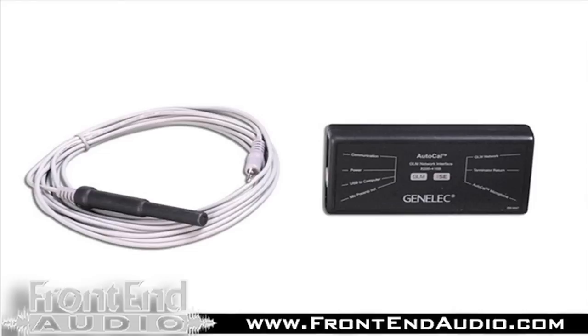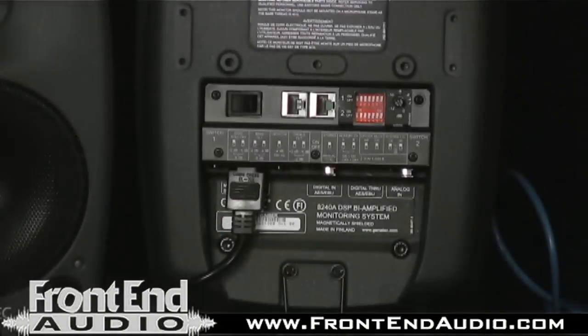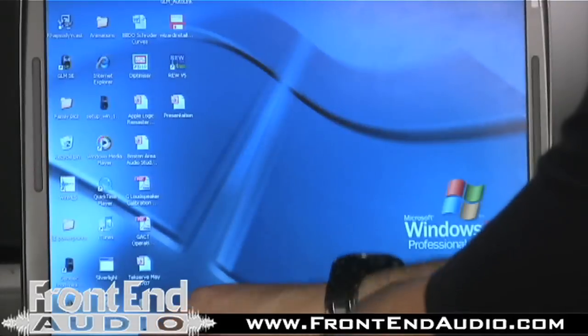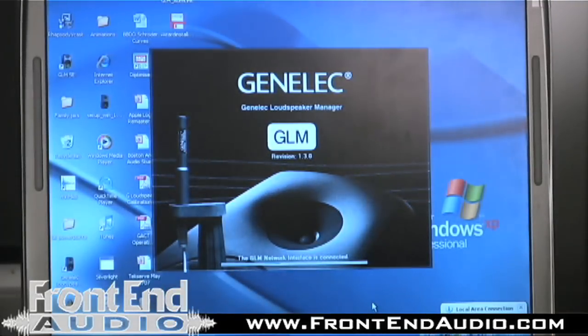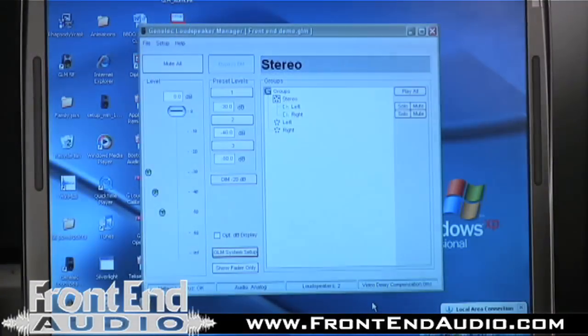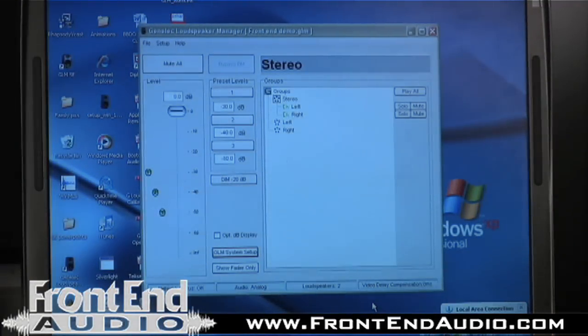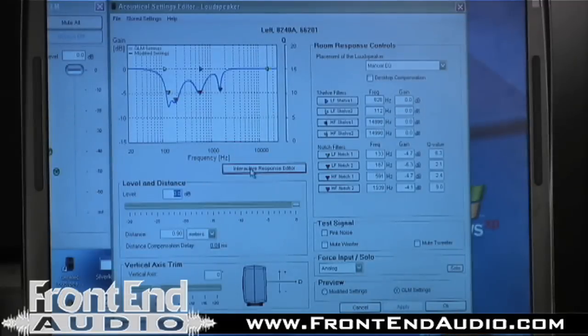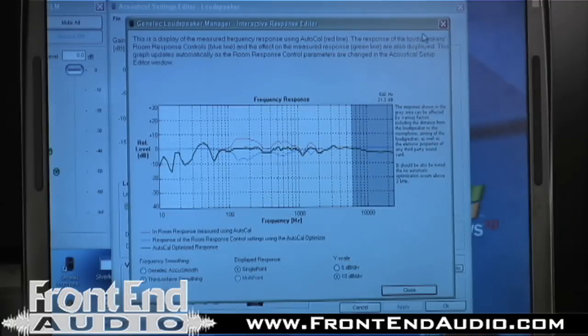That, with the added software, can give us a first-hand view of what our room looks like at the listening position. Calling up the software, we already did some calibrations in this room. I use a function called auto-link, which allows me to use a quick key to open up a given file. So here we have our listening position — you can see our main page here. And if we move into the acoustic settings page, you can actually see what GLM has done to calibrate the speaker to its listening position.